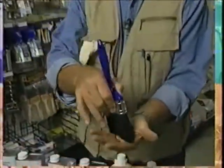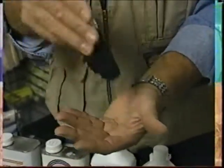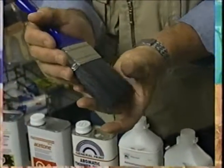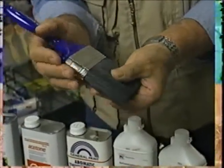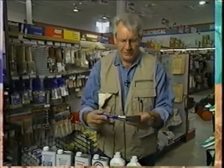When it comes to water-based products like latex or acrylics, no way — don't use a pure bristle brush. The reason is that when you dip any pure bristle brush into a water-based product, whether water, latex, or acrylic latex, the bristles will blossom, blow up, or swell. When that takes place, you've got a real ball at the top of the bristle, which makes for a miserable paint job. It also streaks and pulls out hairs.